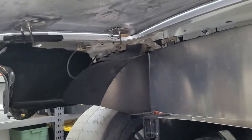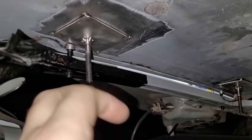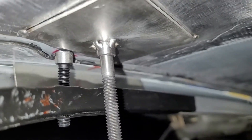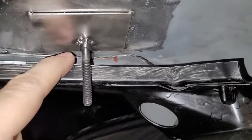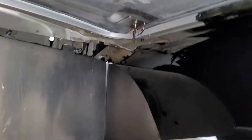That's the next day - we were too tired last night to continue but we're back. We grabbed our grade eight bolts, ground the head to get the black oxide off, and welded four or five little tacks to each plate - got that done on all of them. There's our bolt with this hole right next to it. Right now there's a nut on top pushing the bolt up to set our spacing. The panels are not bad, not perfect, but close - this is for final adjustments after all this stuff is built anyway.